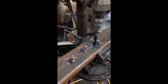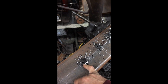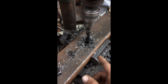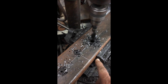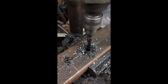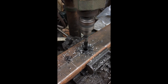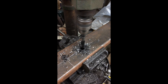After drilling the small center punch pilot holes, we're going to finish drilling out with a three-quarter inch bit — that's the size of the bolt. I'm going to put a sleeve over that and a bolt through it to line it up and drill the hole. I don't have a drill bit that will be like an inch and an eighth, and this drill press won't handle it, so I'm going to grind it by hand. Then we're going to bolt it up to the tractor and line it up, and I'll show you how I tack weld it in place so that it's perfectly lined up.